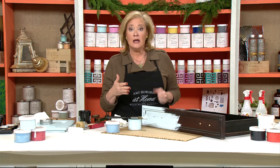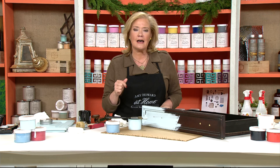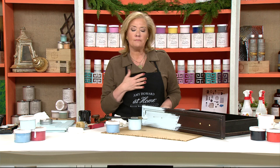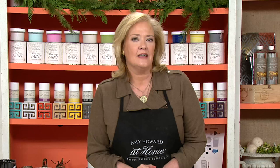For the china cabinet I painted the inside by spraying it. If you want to spray, it's great for kitchen cabinets, but you'll need to thin the paint about 15 to 20 percent following your airless sprayer's directions. It goes faster but you'll use more paint — allow about 30 percent more. A quart covers around 120 to 130 square feet, so for kitchen cabinets or a china cabinet get at least two quarts. Please stay in touch on social media and go enjoy the bragging rights!